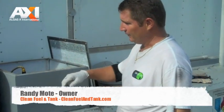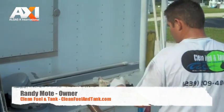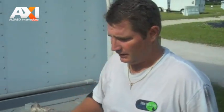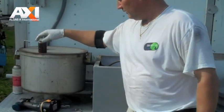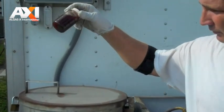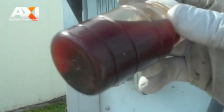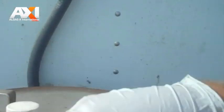When I came this morning, I was sampling just with a small pipe right in this area. Underneath these two-inch vents, I saw some water, microbial growth, water, or sludge rust in the bottom of the tank, and so we're going to target that first.